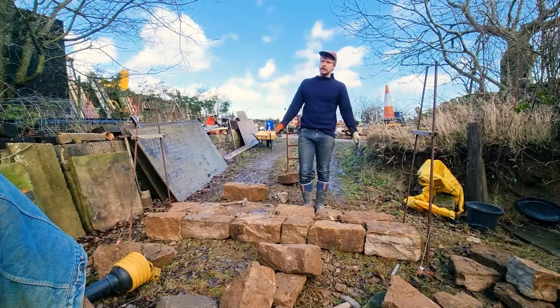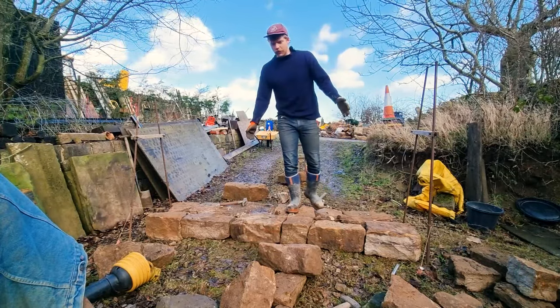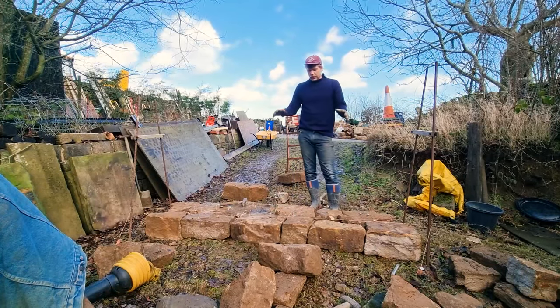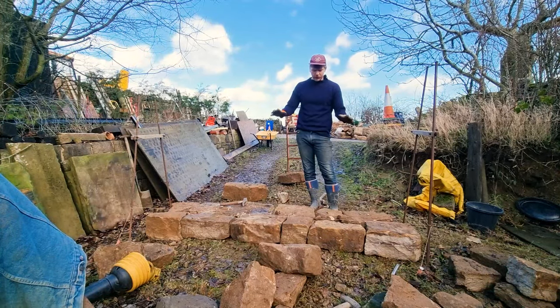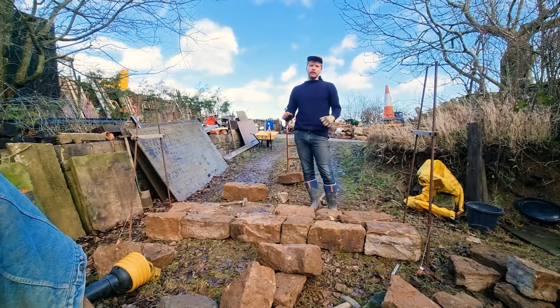Of course, if you did rock your foot around on it, put all your body weight on it, moved it around, it's going to rock. But you try moving it when there's a ton of wall on top of it, it's just not going to happen. There's all that pressure coming down onto that stone and pushing it into the ground, so it could never move.